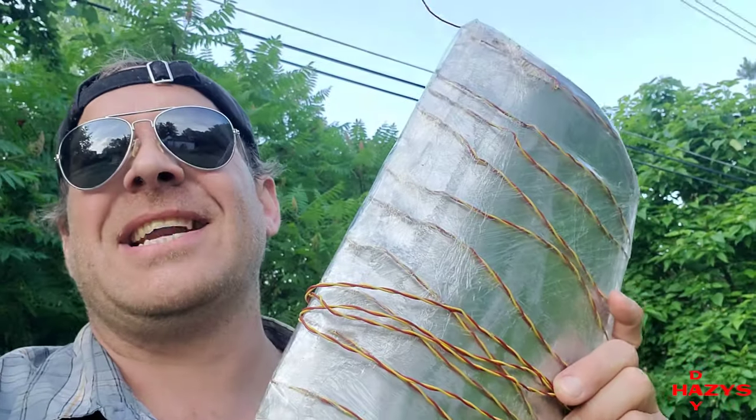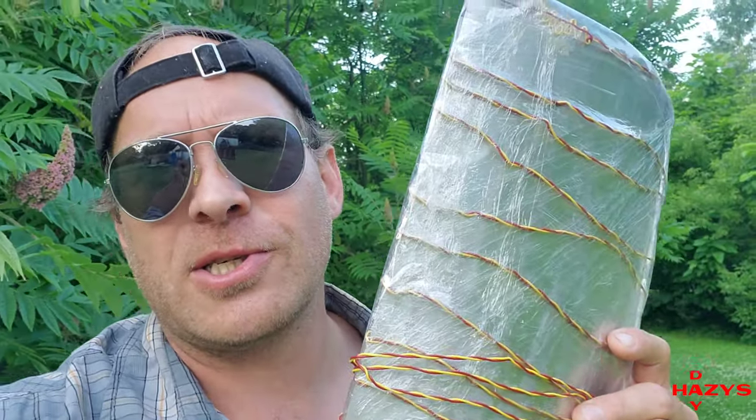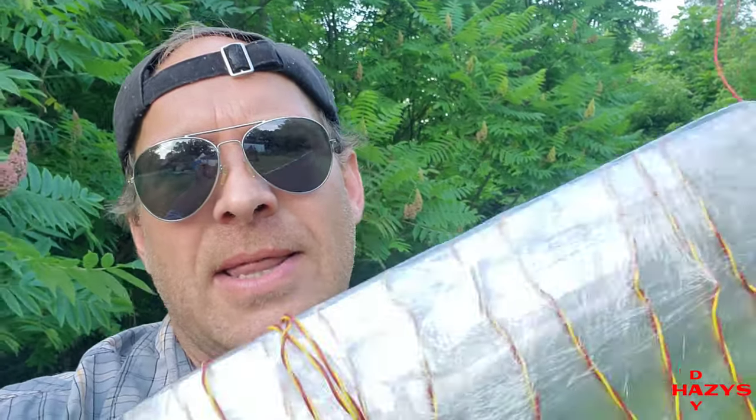There it is — one quickly completed indoor HD TV antenna made out of scraps from your garage, home, or office. I took some of the turns out before I wrapped and sealed it in plastic — you want about 13 turns around the aluminum plate. After wrapping it in saran wrap, you can take clear packing tape and trim all the edges, then run layers over the center and back. It'll make a tighter, more secure plastic coating — much better than saran wrap alone since it won't tear as easily, and it'll also help protect and guide the signal down the wires.